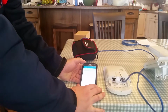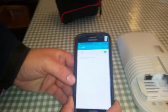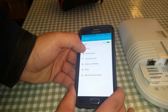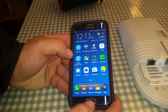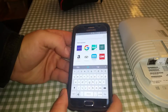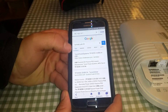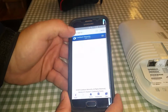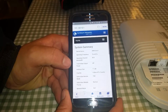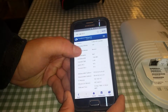You just hop into Wi-Fi, and this has a small wireless router inside it. So you just connect over to your router that's inside the case, and just put in the IP address of whatever radio you're looking for. Just make sure that this is on the correct one, and it just logs you into the web GUI for whatever radio you're trying to aim up on a roof.